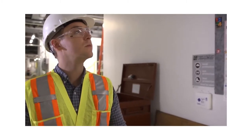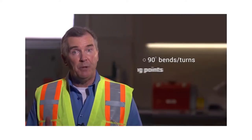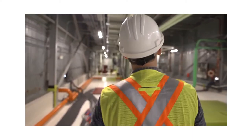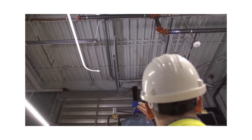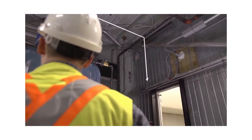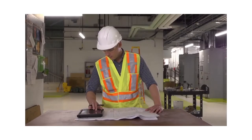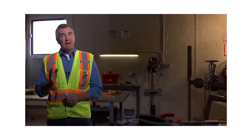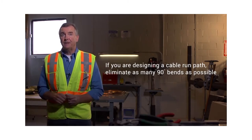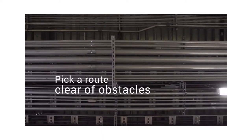Take note of the type of cables involved in your install — large, medium, and smaller gauges — as well as 90 degree bends, bracings, terminations, and enclosure entries. As you begin your walkthrough, make note of exactly where all the 90 degree bends will be and where the cable will go from horizontal to vertical. This can already be determined in the line drawings provided by your engineer, or you may have been given some flexibility to design the portions yourself. If that's the case, make every effort to eliminate as many 90 degree bends as possible, and pick a route that's basically free of ductwork and pipes.